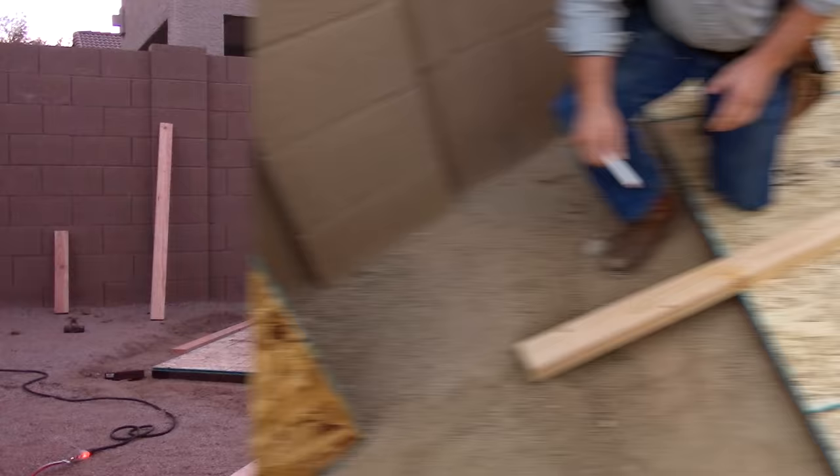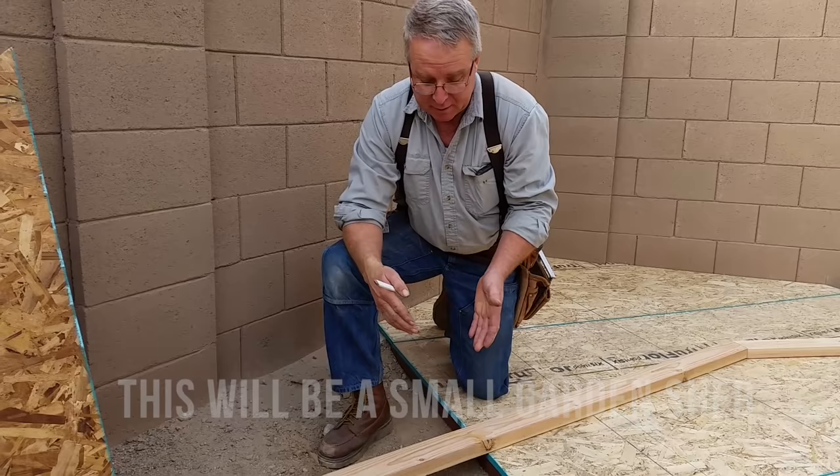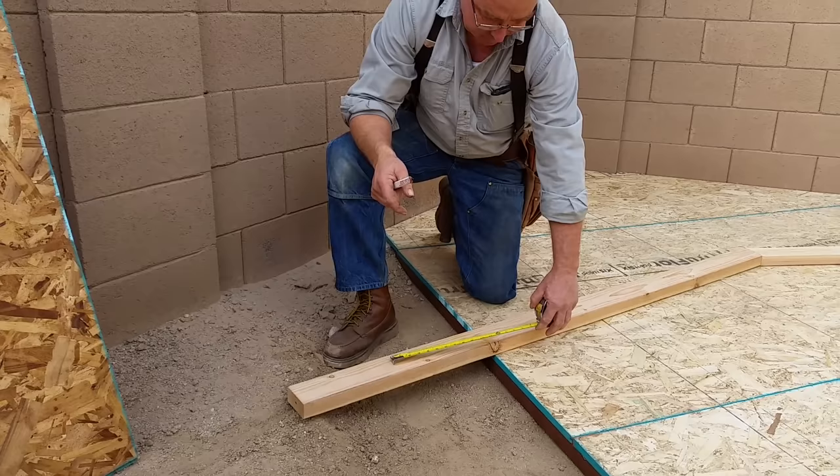If we were in the Pacific Northwest, we would want to extend that to get the drip line away from the building. In Mesa, Arizona, mostly we're just worried about sun and not creating a big obstacle or hazard for head bumping, since this is such a low building in their yard. So for this board, I'm thinking a 10-inch overhang is going to look proportional.